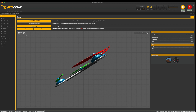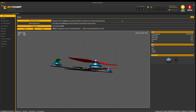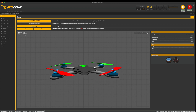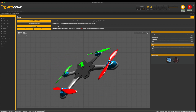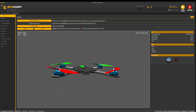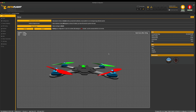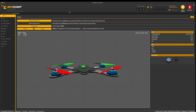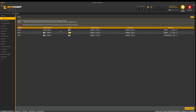The first thing to do is check configuration. If your quad is turned around and the rear isn't facing you, hit reset Z axis — that will bring the quad facing you with the rear toward you while you hold it. Check front, down, back, left, and right to make sure all axes look right. Enable expert mode and you'll see more tabs on the left. Check the ports — this quad only has two UARTs. Serial RX is checked because we're using SBUS. If you're using an SBUS receiver such as XM Plus for Frsky radios, make sure Serial RX is checked.